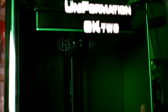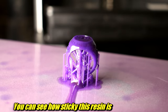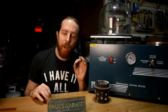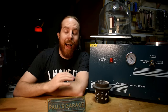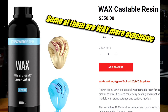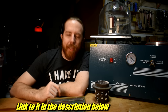For printing I used a Uniformation GK2. Any modern resin printer will print this resin, but it's got some quirks because it's packed full of wax. As the weather cooled off — into the 50s Fahrenheit overnight — I started having problems with other printers. But not with the Uniformation GK2, which has a resin heater that keeps the tank at a consistent temperature. Turns out the difference between 85°F and 55°F is enough to cause problems. This resin is about $70–75 a bottle, so I can't afford to waste it on a bit of cold. I had zero failures printing — printed about 20 things without a single failure.